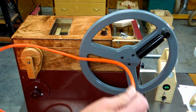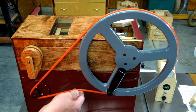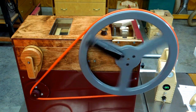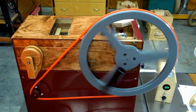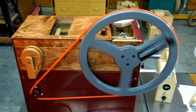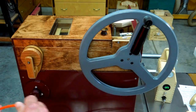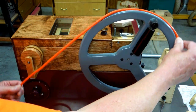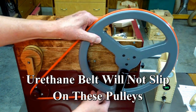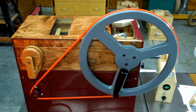You want to put this on, put it down here, and drape it around the big pulley. You can see that's fairly loose. When you get ready to rewind, you just slip it off. This is actually maybe just a little bit loose, but it will not slip on there, so it could be a little tighter — not much. It has plenty of contact with this drive pulley. That's perfectly enough.